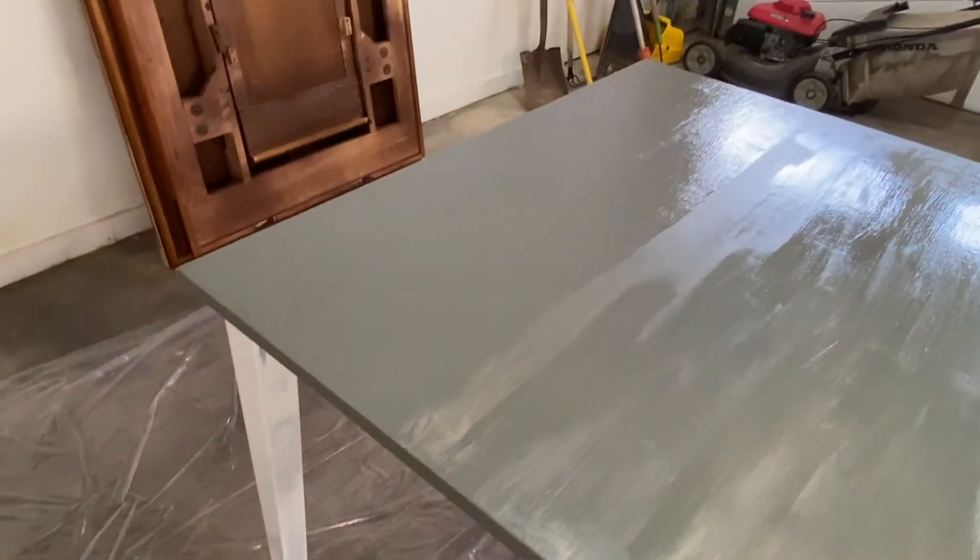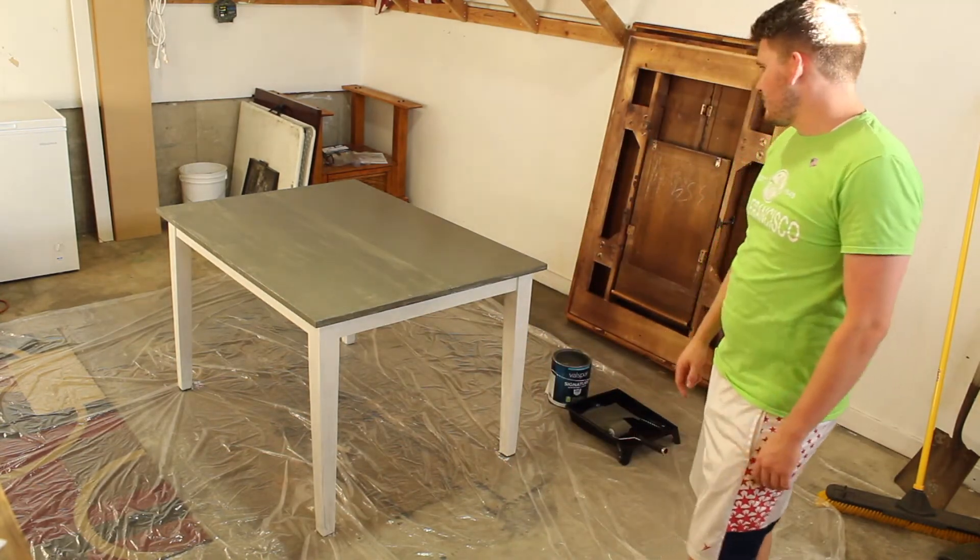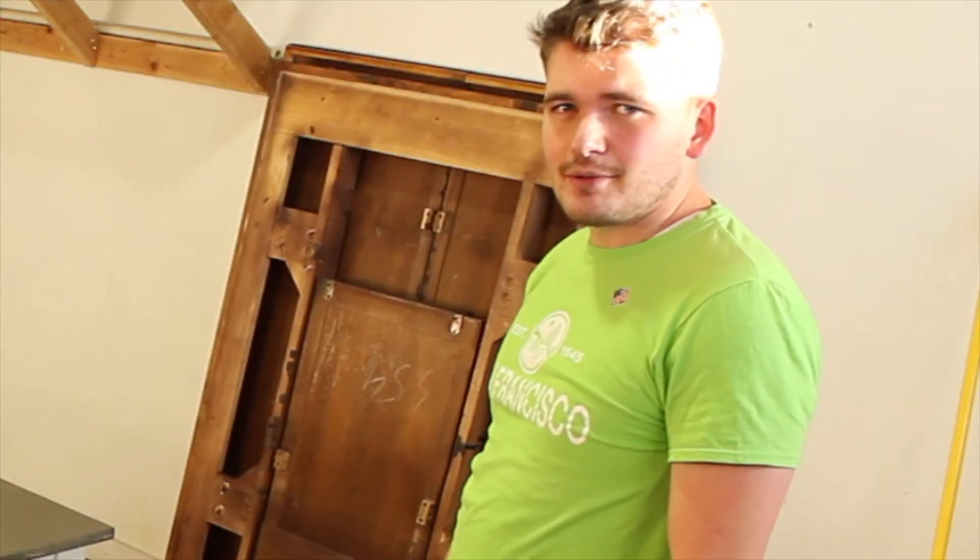If you want to see how much smoother a roller is versus a brush — just look at that huge difference. That is a lot smoother. Oh yeah, I like that so much more. And on the edges too — if you look at this edge up close, you can see the brush strokes in it. But as soon as you come over to the side that I used the roller, it's just a solid line all the way across. Tiny rollers for the win. Valspar, good job making those tiny rollers — it's turning out so much cleaner, so much nicer.